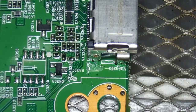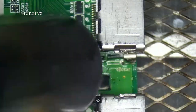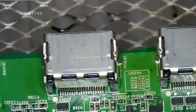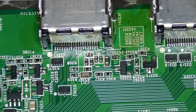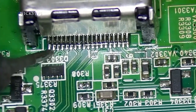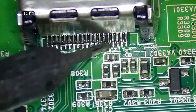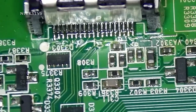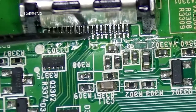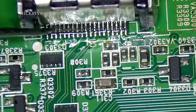I'm going to hit the other side a little bit. Now, we're going to be switching over to our smaller soldering tip. I believe we should already have enough original solder still on the board without needing to add more. Let me do a quick check — just want to make sure all my pins are soldered on properly. This one's loose, we'll have to go over it again. So all of these on this side are loose.